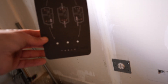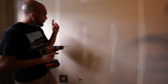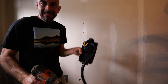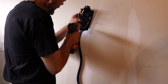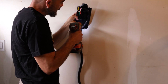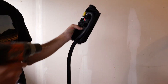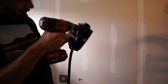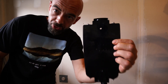We're going to take this plate and use that as our template on the wall and mark our holes. We have pre-drilled our holes into the wall. The next thing you need to do is pre-drill the holes into the charger itself — you can see on here the holes are there but they're not drilled out. So we're just going to put this against the wall and drill out our holes. Just like that, we've got two pilot holes into the charger itself as well.